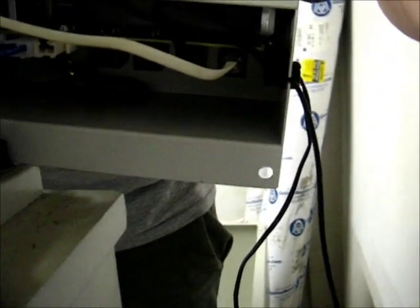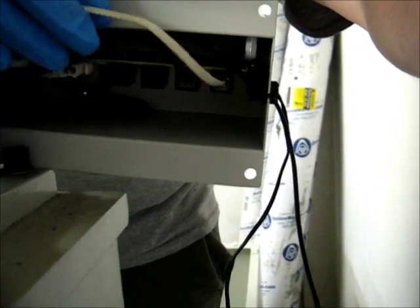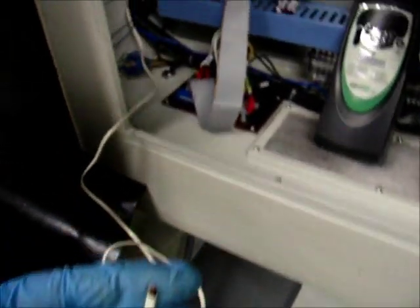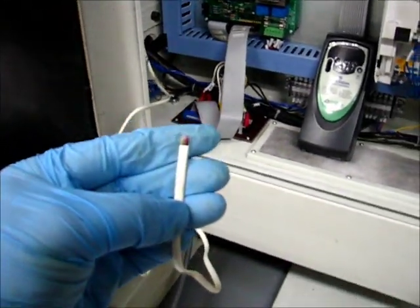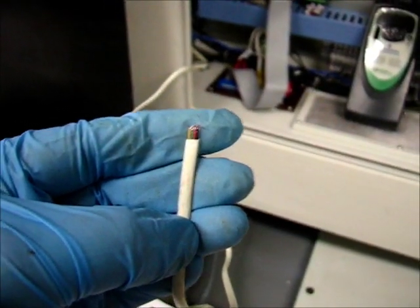I plugged it in for demonstration purposes here. The white wire is in the correct port — there's the orientation of everything. I've pulled the phone cord cable, the RJ11 cable, through the column now. I found it a little bit easier to get through once I took the plug off the end; I was having trouble getting it down.